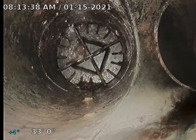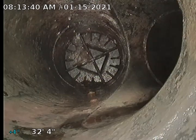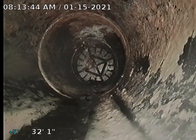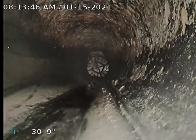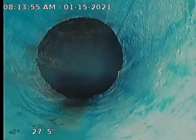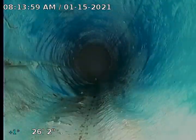We're going to look at this upstream liner we installed as well as the pipe work, and then show you the downstream work. Coming back from this point up under the garage, this is black ABS plastic pipe running under the foundation that then lips into our liner here. So a 4-inch diameter new flow cure-in-place pipe liner was installed right there, starting and coming back.